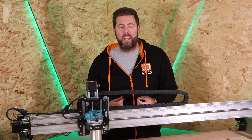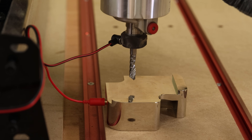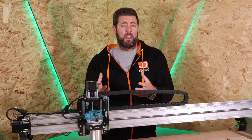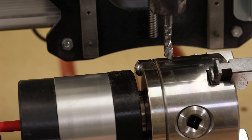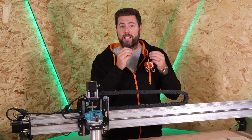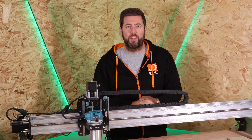This has multiple benefits. For example, if you're changing a bit for a job and you worry about the head moving, we can use the G30 command to always return to the exact same starting position we began at. If you probe off the surface of your bed, we can leave the probe in the same position and always tell the machine to go over to that position to do the probing. Similar thing if you're using a fourth axis — you can tell it where the top of your fourth axis always is. The main one I use it for is basically fear of a job failing or a power cut. I always know I can return to the same starting position and guarantee a smoother cut after that point.